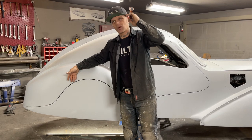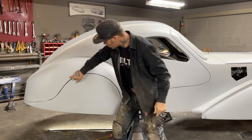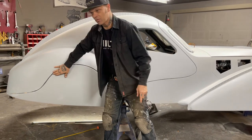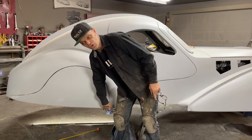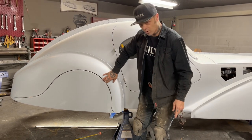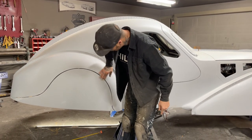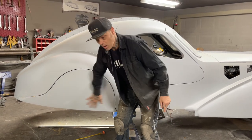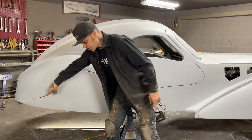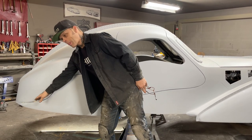This car probably will never run through water, I'm hoping, but that's what I was thinking in my brain when I did that round rod around the edge of the whole car. That gave me the opportunity to make another piece of round rod and weld it to this round rod to get the shape of the fender skirt. Jolene decided a couple weeks ago that she wanted fender skirts on it — and I'm glad she made that choice because it makes the car look so much better. We sheathed it, she welded it on — she did a beautiful job. We made brackets for the inside; it bolts on the inside, has a pin up top.